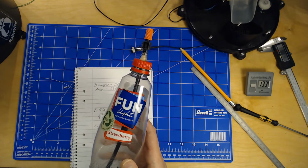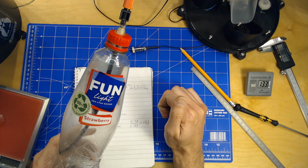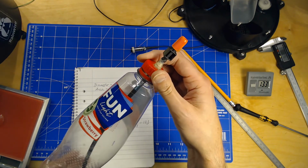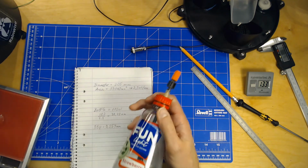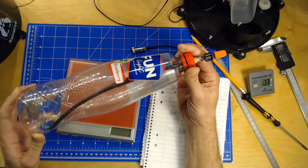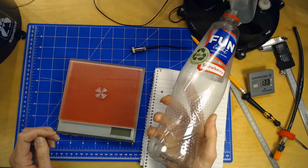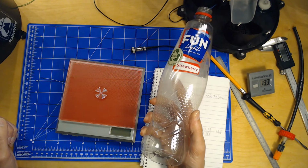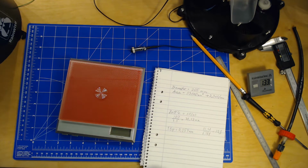Yeah. So, how do you establish the volume in this one? Especially now, if you add this hose in here, that's going to take a few centiliters. So in my case, when I fill this up completely and screw it tightly here, it's completely full. You should do this before you drill this hole, because otherwise it would seep out. So you measure how much it weighs, the total volume here. You can exclude the hose, it doesn't really matter. Then you measure how much the actual bottle weighs, so you can subtract that, and then you will get the volume. One milliliter equals 1 gram, so it's simple enough to calculate.